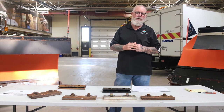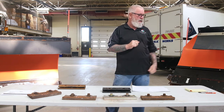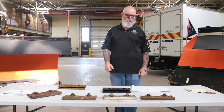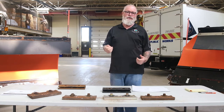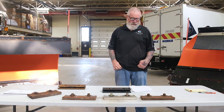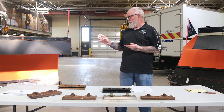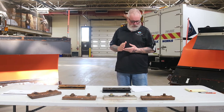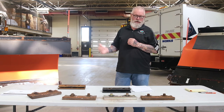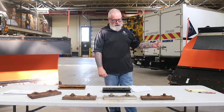One of the things I was really shocked by was the reduction of noise and vibration. My operators can go out in this truck today, put the blade down on the ground — we run belly blades, and this one has a sectional belly blade as well, very similar but by a different company. They will adjust their blades continually because they don't even hear them. We did some studies on our very first trucks before we went to sectional blades. We were getting about 100 decibels inside the cab of the truck with a mild steel blade, mild steel underbody, and carbide end pieces and carbide wear plates. 100 decibels — at 15 minutes, that is the permissible exposure time limit, meaning anything over 15 minutes you're actually damaging your hearing. When we went to a PolarFlex front blade and a carbide underbody system, we were able to lower that from 100 to 90 decibels.